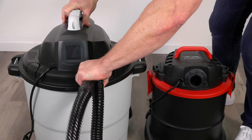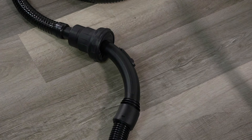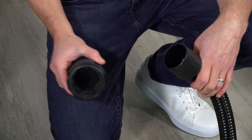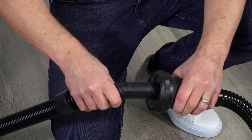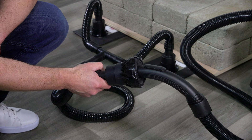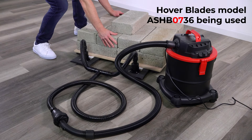AirSled Hoverblades naturally work with 2½-inch blower ports. However, there are shop vacuum models with smaller blower ports which are incompatible with the Hoverblade's 60-inch lead hose. For those models, AirSled offers a universal iris adapter. To use the iris adapter, first connect the shop vacuum's original hose to the blower port. Press the Hoverblade lead hose firmly into the adapter and engage the rotating iris end to a starting diameter. Insert the shop vacuum's hose end into the rubber iris and rotate it to form a tight seal. Because the adapter's sensitive locking mechanism may inadvertently release if bumped or pulled during use, reinforcing it with duct tape is recommended. The universal iris adapter lets this shop vacuum, whose blower port is smaller than 2½ inches, easily power the AirSled Hoverblades.